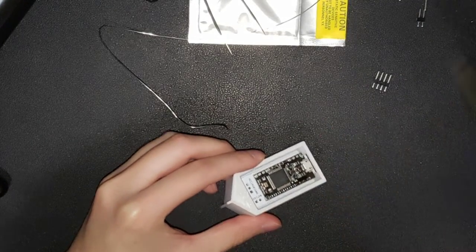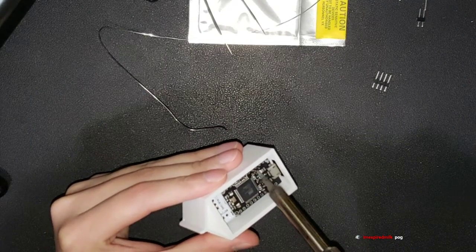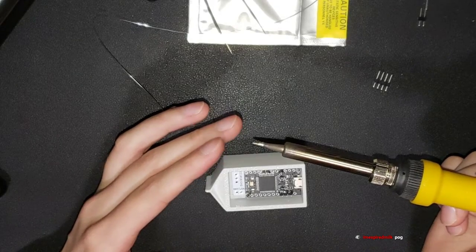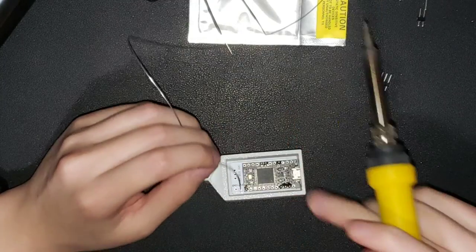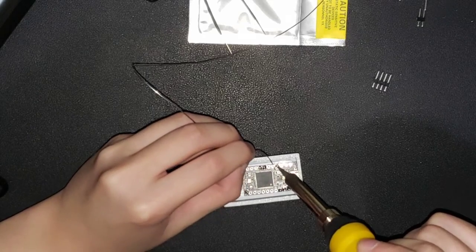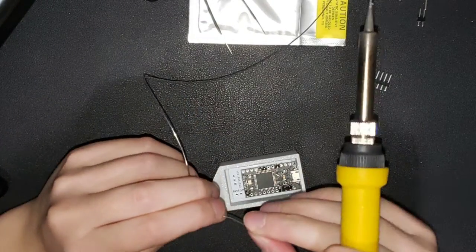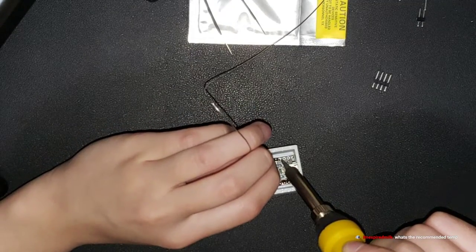So if you're having a lot of issues like me about cold joints, it could be shitty iron, right? Maybe your soldering iron doesn't heat up quite as evenly. So it's kind of a lot about testing, seeing whatever works for you. Also the thing with temperatures, yeah, very much trial and error. But yeah, cold solder joints are not cute.